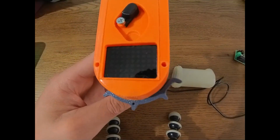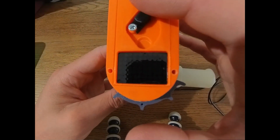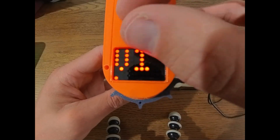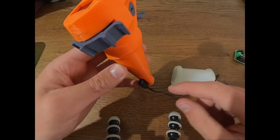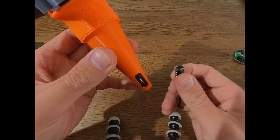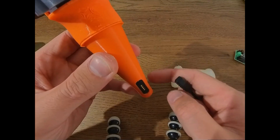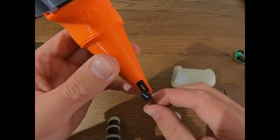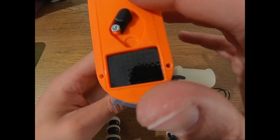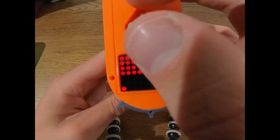One thing that can happen, for example, if there's dirt in your connector or if your USB power source is not big enough, when you turn the remote on, it will go immediately into this boot menu. That's how you know it's not charging properly. In this case, first of all, of course, check your 5-volt power source. And also what you can do is to just clean those contacts, especially if you've been in salt water or dirty water. They could be dirty, so just clean them, reseat the connector, and then once you plug in and turn on, you should see this charging indication again.